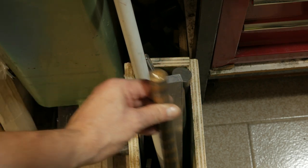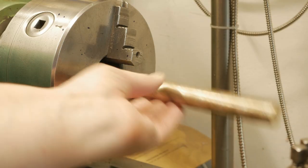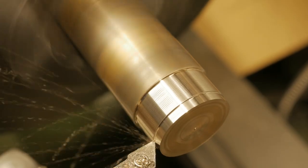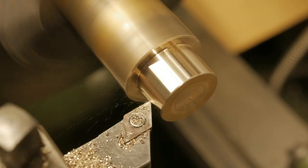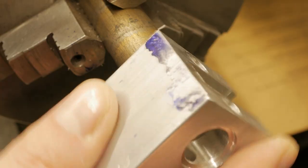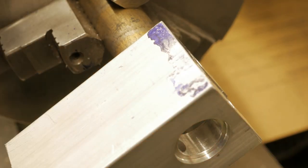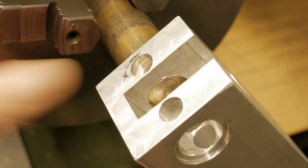The two bushings that I built are made totally from solid from a 21 mm diameter bar. The thickness of the bushings was 1.5 mm for each side, more than sufficient for the few rotations that the central shaft has to make.